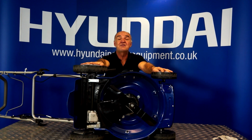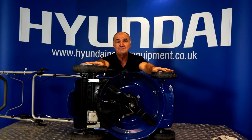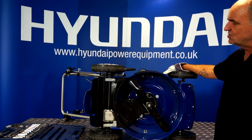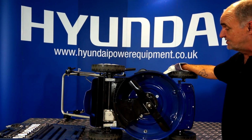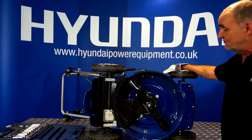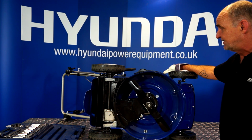Should you have a mower with the 3-speed gearbox, such as the 51 SPE, the setup of the belt is slightly different, and we're going to show you a video of this at a later date. So what we're going to do is look at the tension of the drive belt and its condition. If it's all torn up or broken or jumped off the pulleys, then obviously that needs sorting out. But if it's slack, that also needs sorting out.